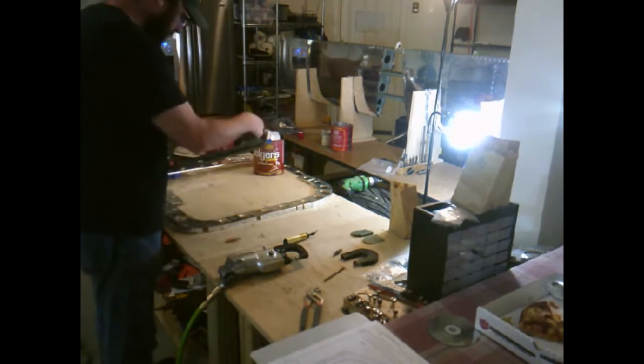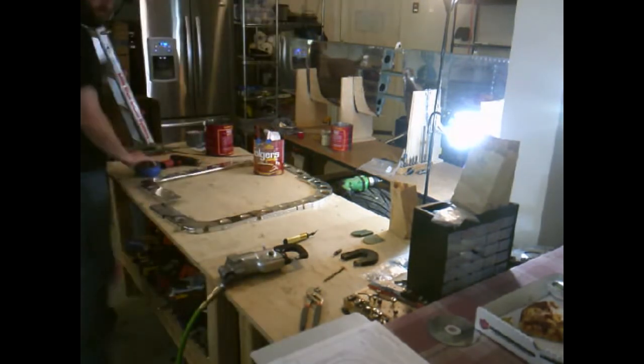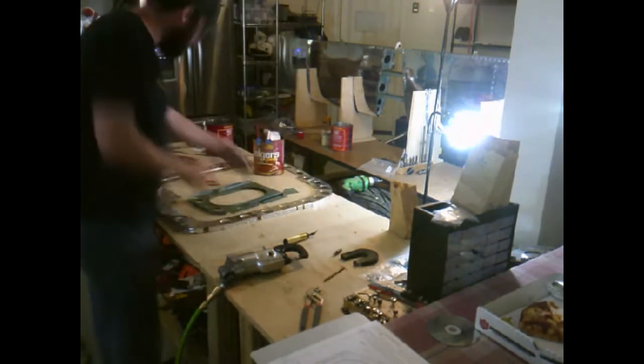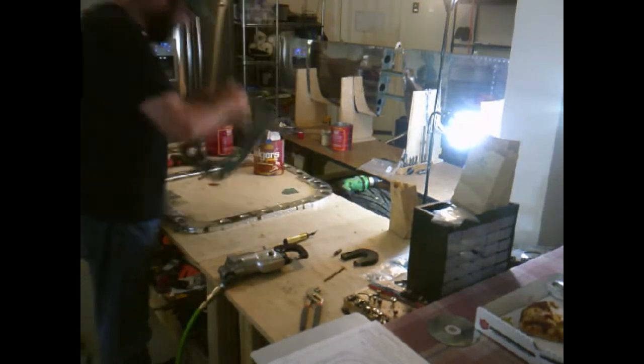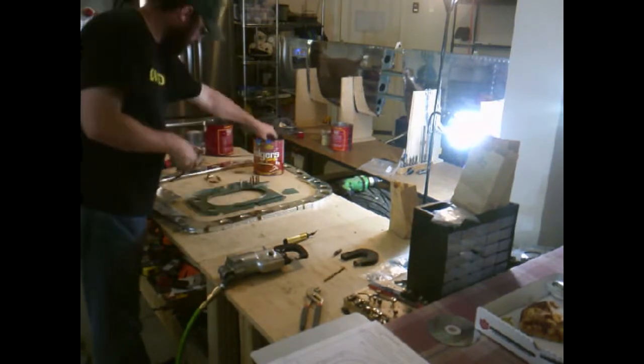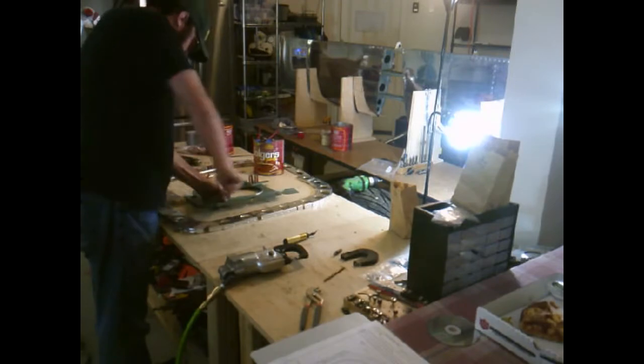But it makes it so much easier if you don't have to sit there and figure out how many washers to put in there. So if you have a pneumatic squeezer, which I highly recommend you have one, you want to get the adjustable ram for the pneumatic squeezer.